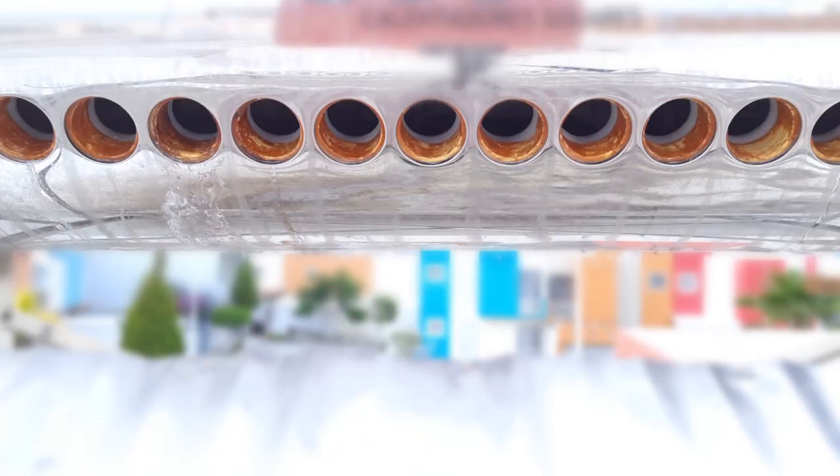And here we have all the new silicon seals in place. Remember to lubricate the inner sides of the silicon seals with dish soap, and to lubricate the top 10 centimeters of the glass tube also with dish soap before reinserting the tubes. This procedure is shown in my other video and is in the link in the description below.